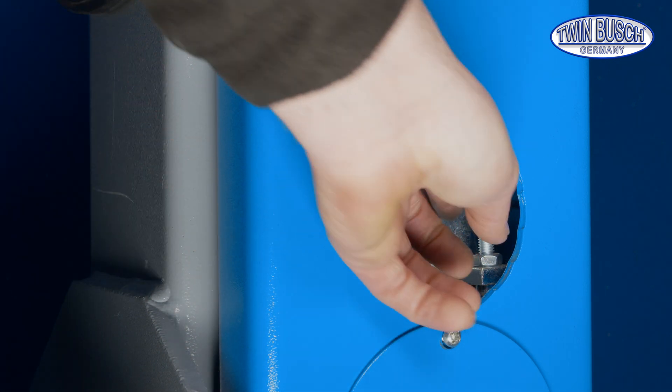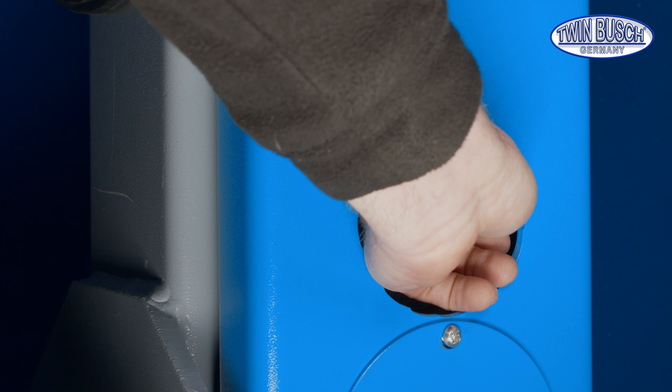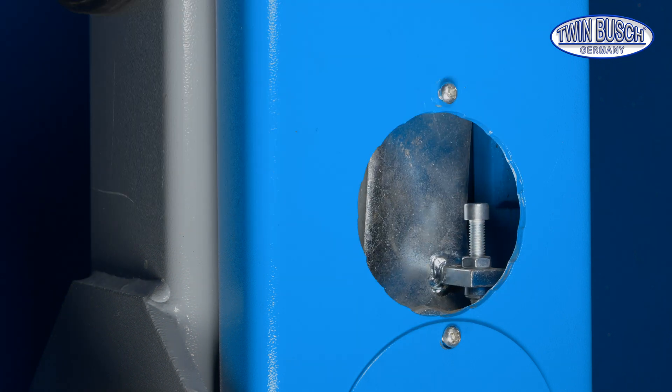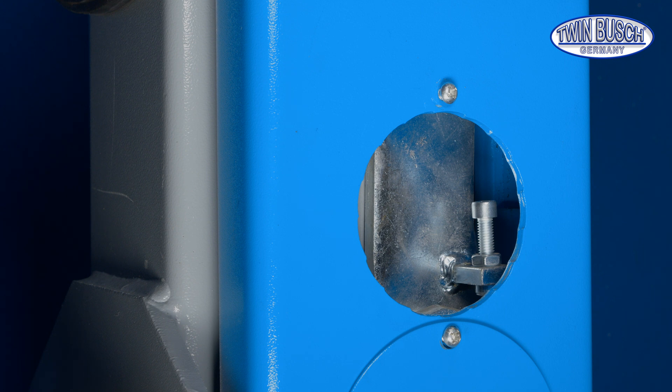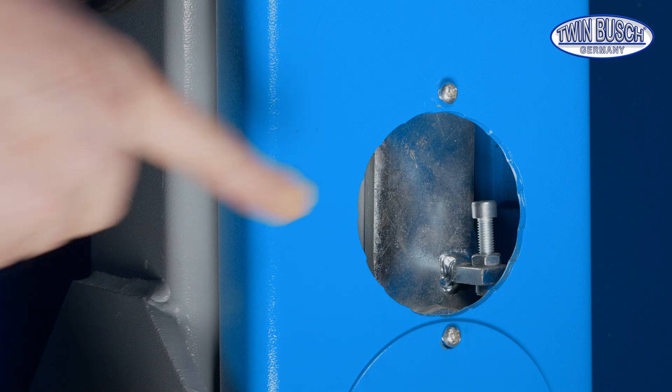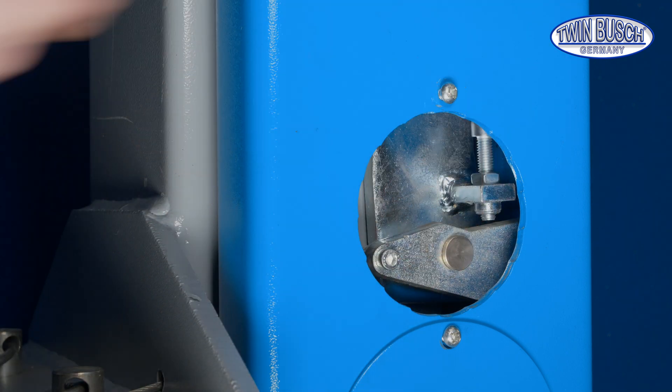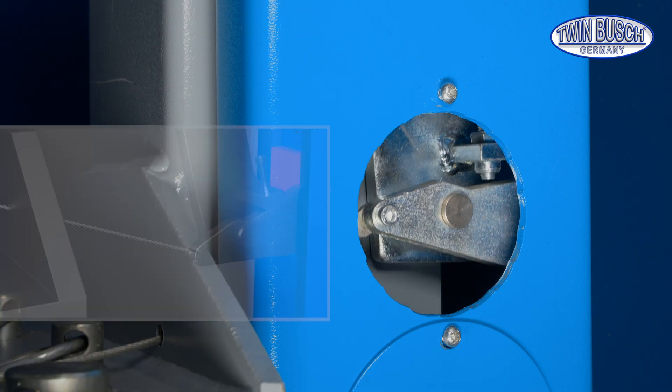I have now adjusted it the other way around. The other problem that can happen is: the lift is released with the cable, and while going up again the rotary latch should fold back and give the catch the opportunity to lock itself again. But in this case, nothing folds back.